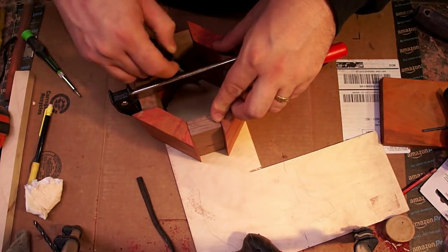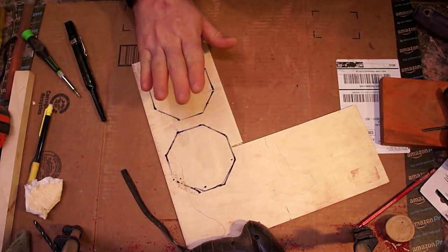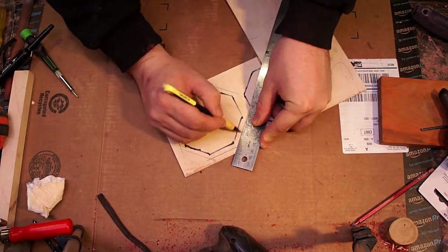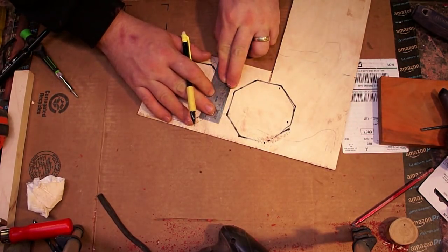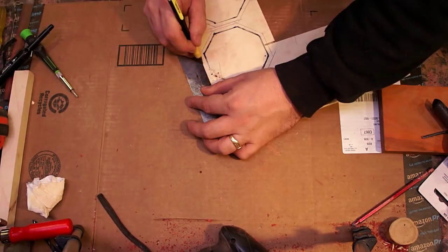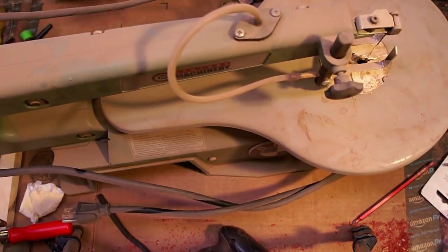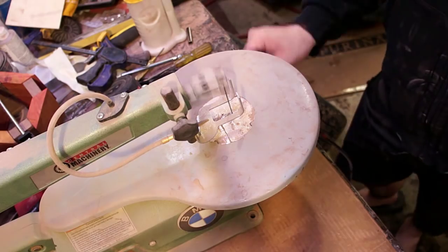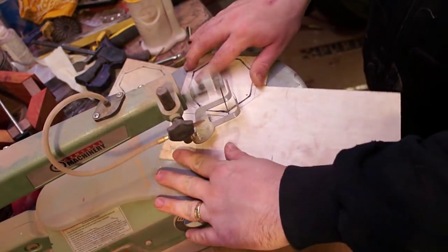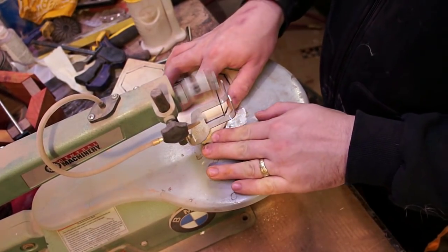Now I'm getting out that 1/8-inch Baltic birch plywood and going through and marking out everything for the bottom. I used the actual pieces of wood I was fitting the bottoms into because they weren't an exact predictable geometric shape. You can see me adding probably about a quarter inch onto each one, which was how deep those channels were cut into the main body. I probably should have gone a little bit bigger and just trimmed them down afterward, because I did have to position them exactly right in the channels.